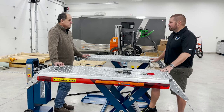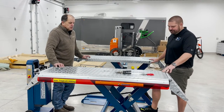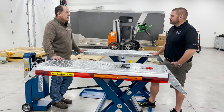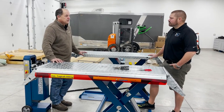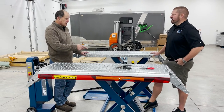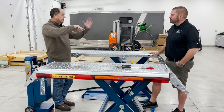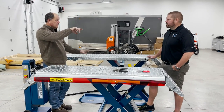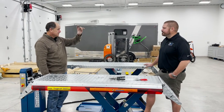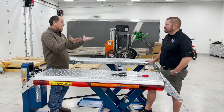And you bring up a Jeep. Is it a newer Jeep, older Jeep? Yeah, newer Jeep. Wrangler? Yeah, JL, four-door. So when you get this, you also have to look at what you're doing under there, because on Jeeps, and I'm not sure on the brand new body style, the JL, the JK gas tank plastic hangs down this far right beside the frame. So you have to get stuff up in there so you can actually lift on things.